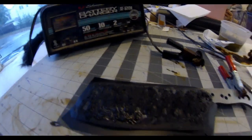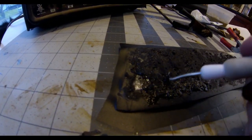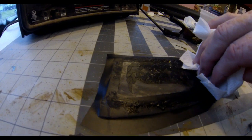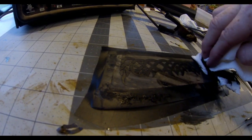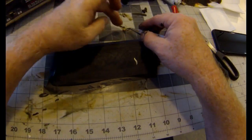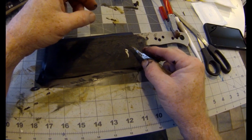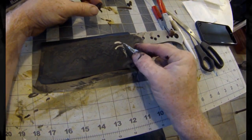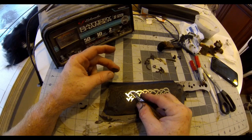After the etching is done I'm going to turn off the battery charger before I do anything else, and then just clean off the face of the blade a little bit. What I'm really doing is confirming the etching is deep enough. You can take your fingernail and run it along the etched area; if you're not completely satisfied, you can lift a little of the vinyl just to see how deep the etching actually is. Once you've confirmed it's deep enough, you can start to peel that vinyl decal off the blade — this is going to expose the shiny areas.